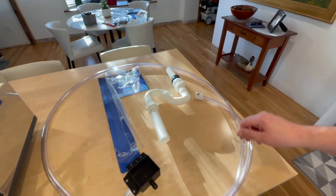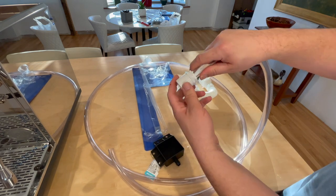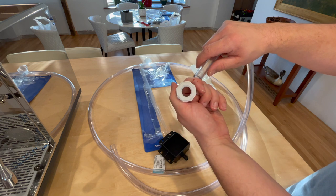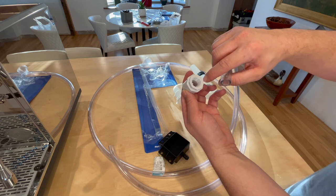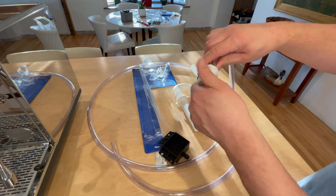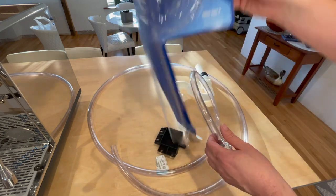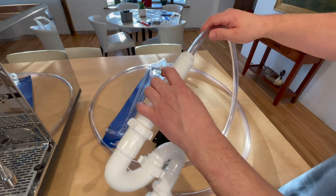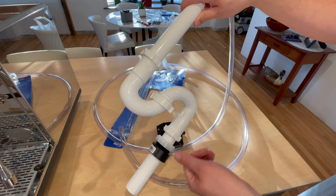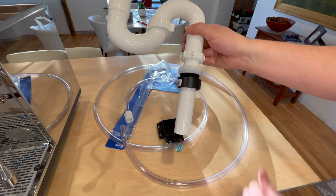The tubing was ten feet long, I probably won't need all of it. On the other end I used PVC threaded collars - this is a one-inch to three-quarter reducer, then a three-quarter to half-inch threaded piece that threads a half-inch pipe on pretty well. I then got a traditional S-trap - just a regular siphon trap. With that little fitting it sits nicely into the top of the S-trap, which catches any sewer gas so it's not coming back up the pipe. Water drips down, goes to the S-trap, and then goes into the actual plumbing.